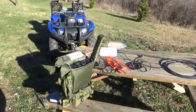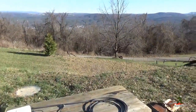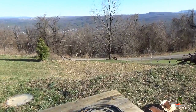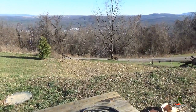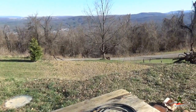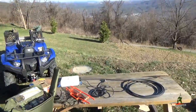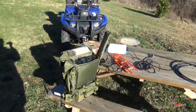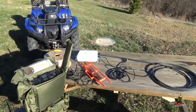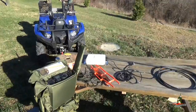I'm going to pack up this stuff and put it on the four-wheeler. We're going to head off the face of the mountain, find a nice secluded undisclosed location, and see how fast we can set up emergency communications with an HF radio in the field — send and receive some HF email with a digital modem, pack it up and bug out. This will show the versatility and mobility of the ICOM IC7200 HF radio and its partner, the AH4 automatic antenna tuner.